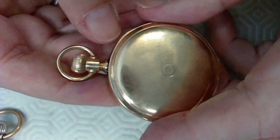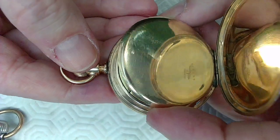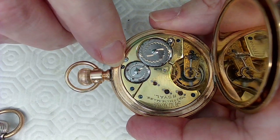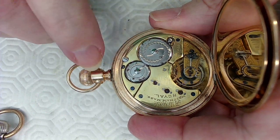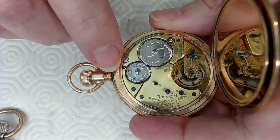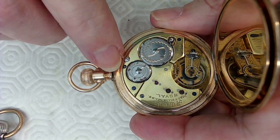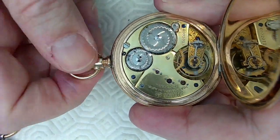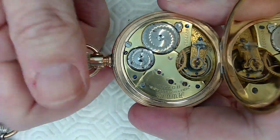Now the tricky part here on this watch, and this is for Andy again, okay? I just put my thumb under here because I didn't close the lid down yet. So there's a watch ticking away nicely. This little screw here is the one that holds the crown and stem in place. If you tighten this too much, it won't turn. If you tighten it too little, then the crown and stem just come right out. So it's touchy as hell. I found out the exact position to tighten it, and I did that, and now it's nicely tightened, and it's in place, and it's working really well. So this is your watch, Andy, so we'll find that friggin' crystal for it.